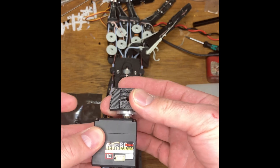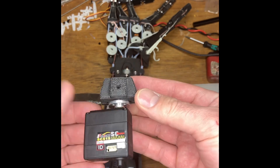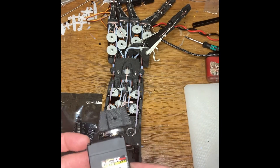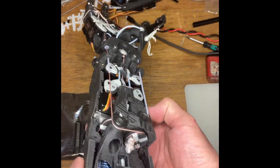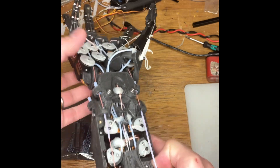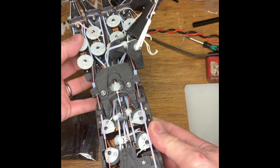For greater range of movement control, these are serial-style servos, but you could use a normal servo here and a normal servo for the two wrist motors — there's one here and one down there. You just get slightly less range of motion at the wrist.